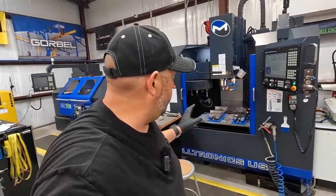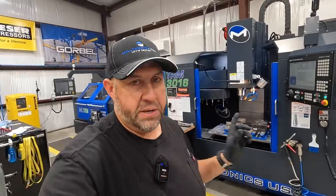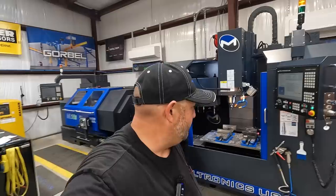Whenever you hit cycle start, there's a big sense of satisfaction when you see those cutters making those cuts after you've done all that programming. Man, I had a lot of fun, especially with that 1-inch insert mill. I had that on the second plate. I set it to 125 inches a minute, so it was moving even faster than the first time. When you see that cutter going around that steel plate making that cut, and the sounds that it's putting off, and you see the chips spraying over at the window, it is exciting. It is a lot of fun to finally see that progress happening and see it making a part there.